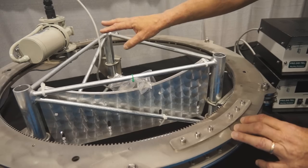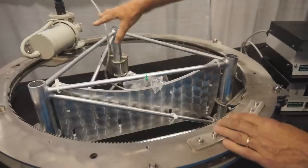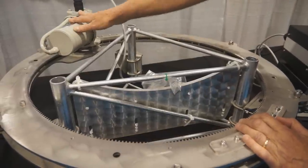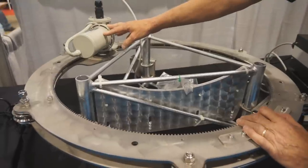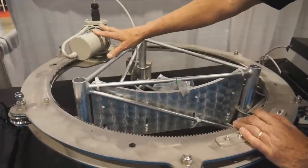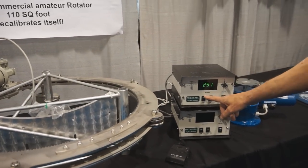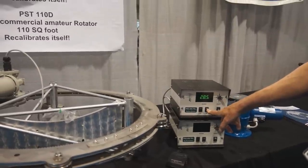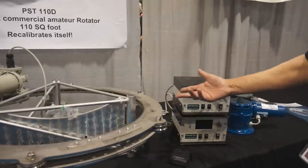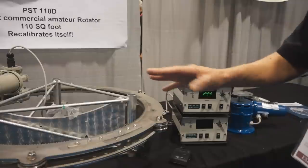There is no adjustment on the motor since this is precision made. There is no slop, as you can see in the construction — the gears are always engaged and it will not jump track like other rotators. Since this is trickle-down from Navy shipboard-use products, the sealing of this motor and its gear boxes meet almost mil-spec. The controller can be used in several modes: you can manually turn it clockwise or counter-clockwise, or use software to limit its travel from 500 degrees down to 1 degree.